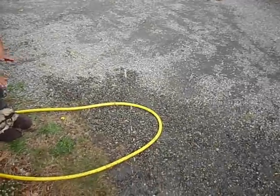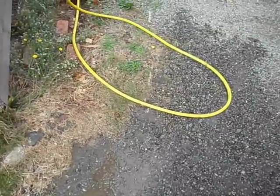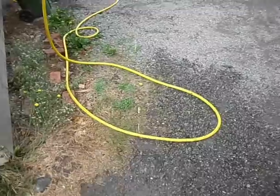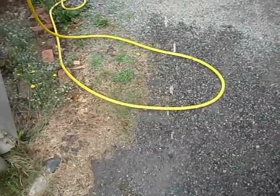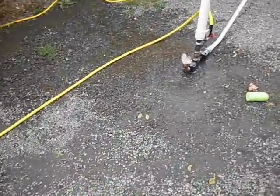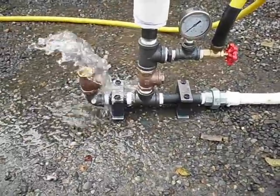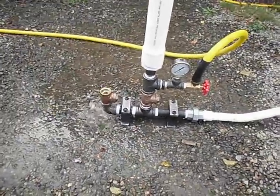That's the water being pumped — it's about 10% or so of the water that goes through the pump that actually gets pumped to where you're going. While this may not look like a very large amount of water, you've got to remember that this thing runs 24 hours a day, 7 days a week, non-stop. That small amount — probably half a gallon a minute or so, times 24 hours — is a pretty substantial amount of water for relatively no cost, with the exception of buying the fittings. I just love that it works completely off-grid, just off the water hammer effect. You can see the whole setup shaking because of the water hammer. So there it is — a little weekend project. Please rate and comment.